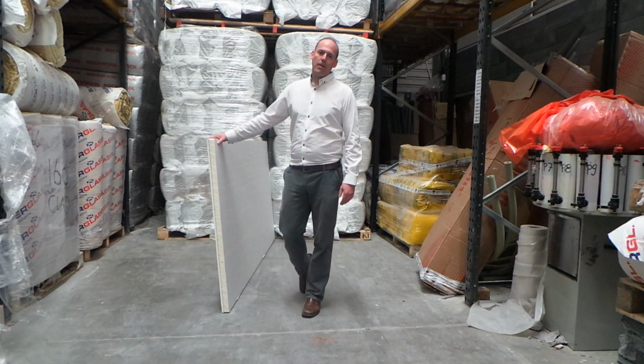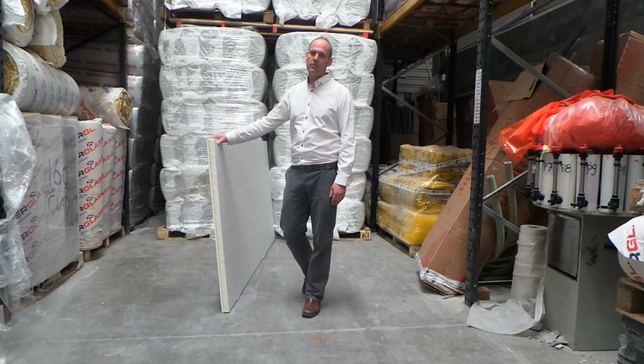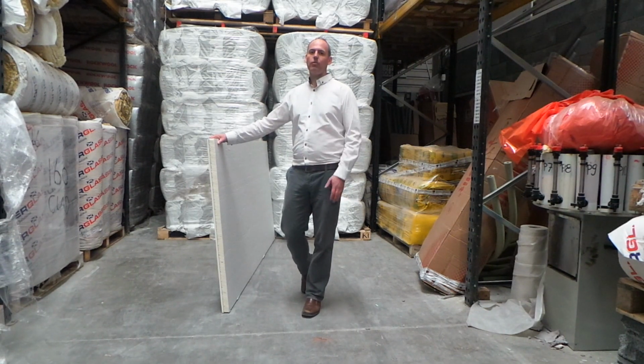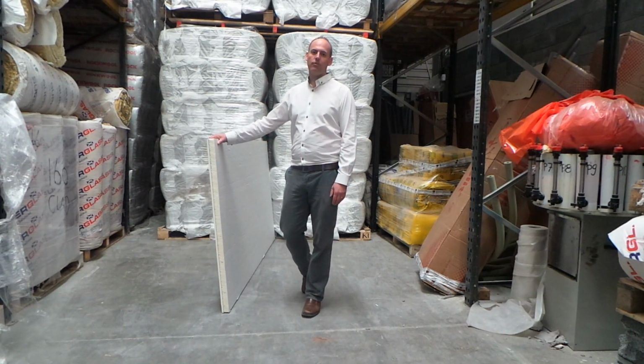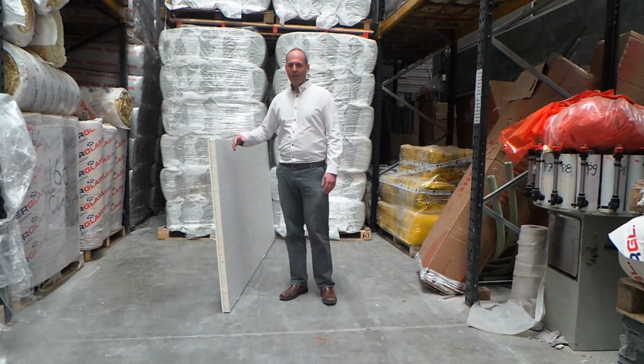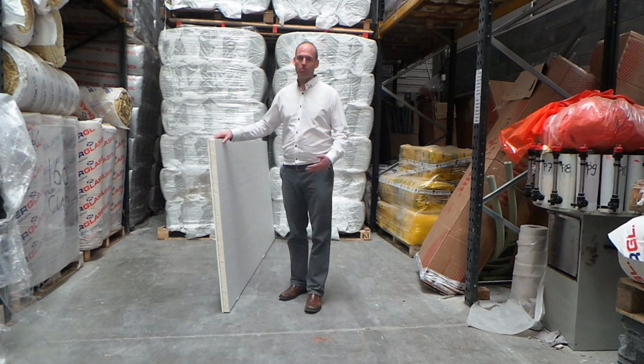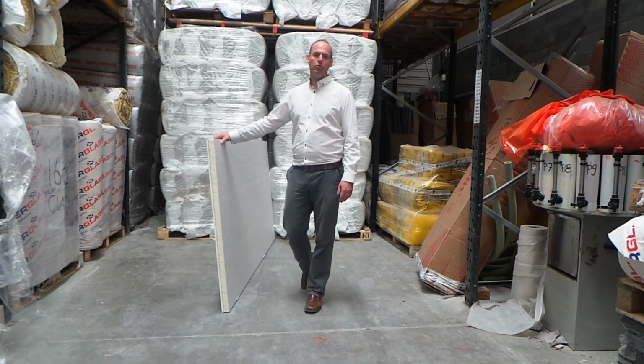Generally we would recommend about 15 fixings per board, but again, it's no harm to have a look at the manufacturer's data sheet, which is on our website, insulationforless.co.uk, to get a full breakdown of how many mechanical fixings they recommend per board. You can also dot and dab these boards, so you can stick them to the wall using a bonding compound, so your plaster would do that for you.